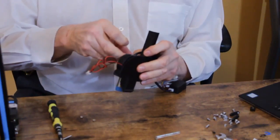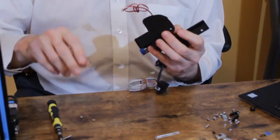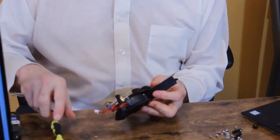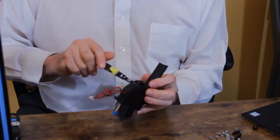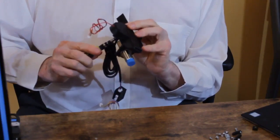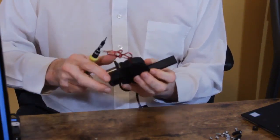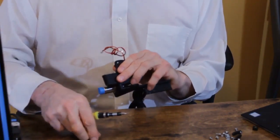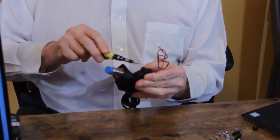Take the 20 millimeter screw that comes with the hardware that we send and push it through. Take the M3 nut and put it in place. There's an indentation to hold the nut, and tighten the bolt. And the bolt will tighten into the indentation a bit, keep it from turning, and allow you to get this reasonably tight. You don't want to over tighten anything because you're tightening metal against plastic, so it's easy to crack stuff if you're not careful. You only need things just snug down.